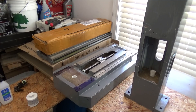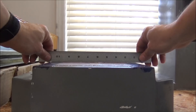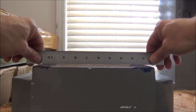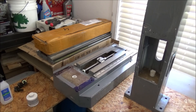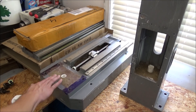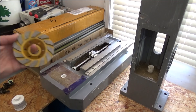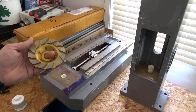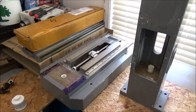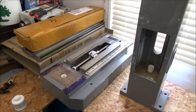I think the piece of wood may have been bowed or something. If I take a straight edge and go across it here, it looks like it might be a little high in the center. So I'm going to have to remove that material somehow, and the best way to do that is with a diamond cup disc — this is for my four-inch grinder — so I'll just use this to grind away that material there and that should take care of the issue.